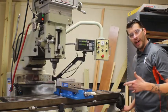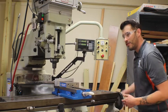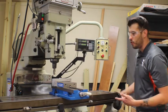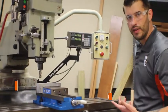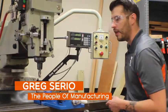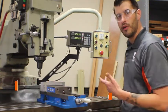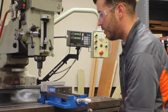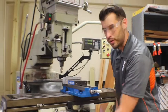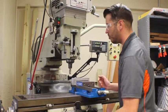When I want to work on my X axis, I walk up to the machine and just get used to the motions — make sure you have smooth movement. This one has a power feed. You want to make sure it has the proper oil and lubricant, and that all your moving parts are moving. To move our Y axis, it'll bring our part closer to us, which is Y minus, or away from us, which is Y plus.